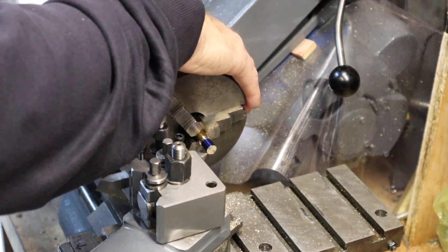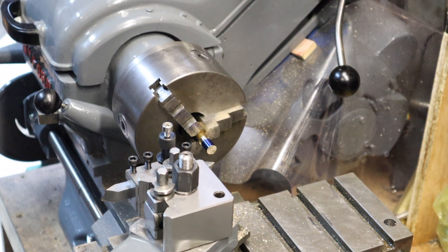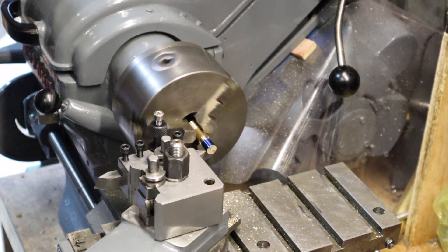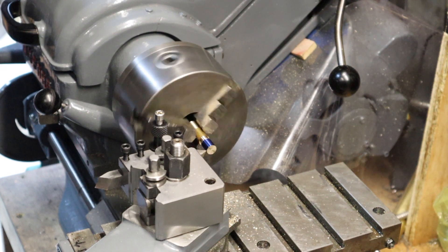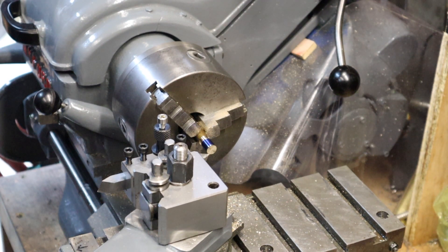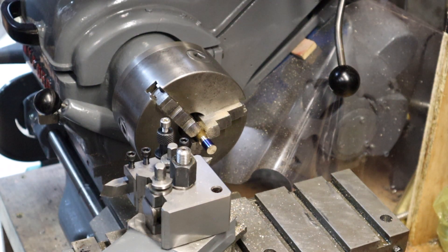So we can slow it down a bit — everything set up. Engage the half nut; that's going to stay in now, the half nut is never going to move. Let's get a scratch pass on that so we know where we need to be. Let's get a scratch pass — it's going to come in at 60. Let's engage the half nut and we can go 65 thou on our first pass. So that's actually coming in at 36.